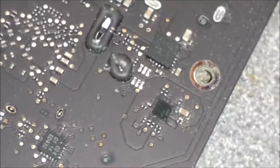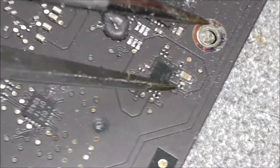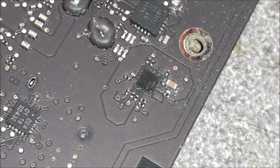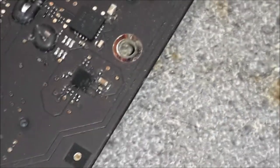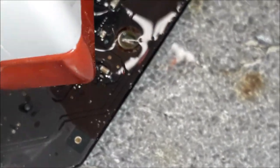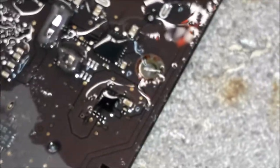After the clean, if it works, of course, you see the dot working here. In the camera, you see it like this, but under the microscope, that track looks so bad, you have no idea. So let me give a quick clean and then I'm gonna have a look. Quick clean, we're gonna use the thinners. I don't use alcohol to do cleans like that. Why do I use the thinners? Because the thinners is stronger to remove any residue. So that helps a lot.